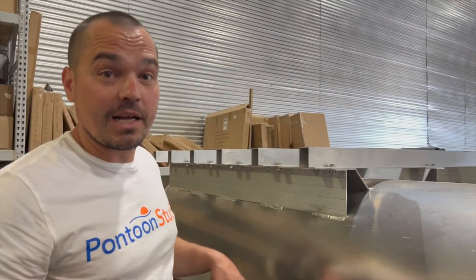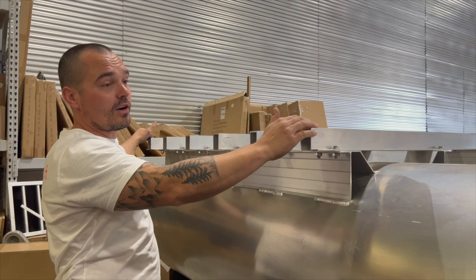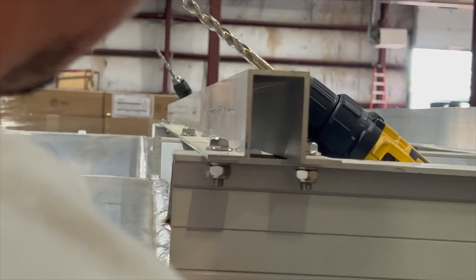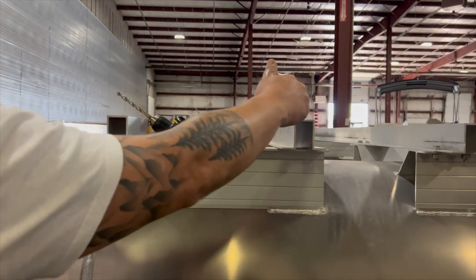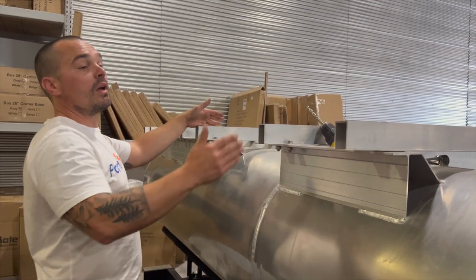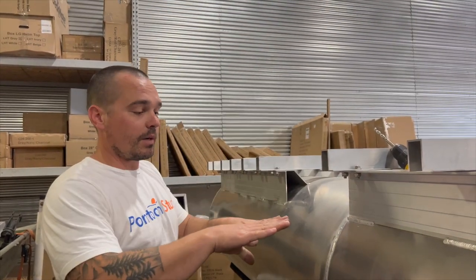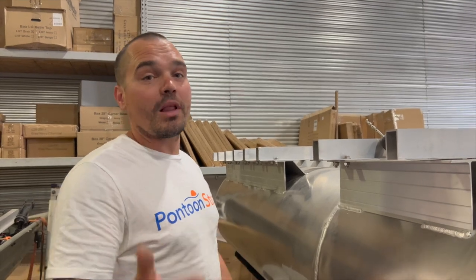This bracket is welded about an inch forward compared to the other side. So instead of just mocking things up where the holes were already machined and bolting everything down, I need to measure from this support to the corresponding support on both sides, drill new holes so everything's square and even, then make sure the seam is correct going forward. It's the only way to make sure everything's square and that the boards line up properly. Remember — you might have to deal with this when you get a blemished or factory-second set of pontoons.